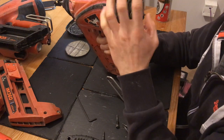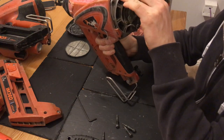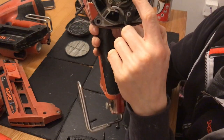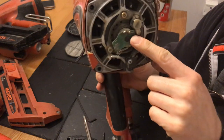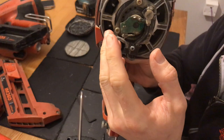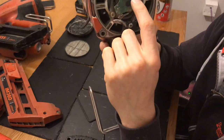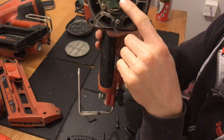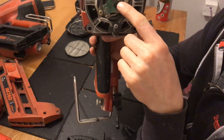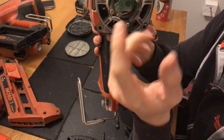In here you've got the spark plug and everything. One of the first things I found was there's a piece of wire coming out here, and you can see where I've re-soldered it back together. The gun wasn't firing at all — it showed signs that the battery was in, there was gas and everything. But on the back here, these wires are prone to come loose — I had it on my PPN nailer as well. It just needs a dab of solder to re-solder it back on, and then it started working again.